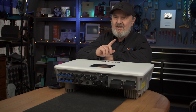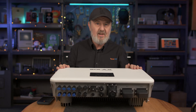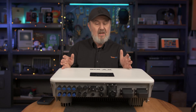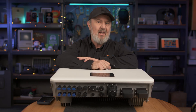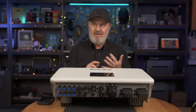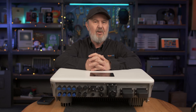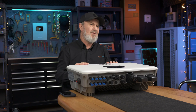The packaging is very solid and well protected. The cardboard insert for wall mounting is a really nice feature. It's compliant with the Australian standard AS/NZS 4777 Part 2, and it also has CSIP AUS compliance natively. In states like South Australia, Victoria, Queensland, and soon New South Wales, this is a feature allowing the network operator — your power supply company — to control your inverter when there's too much solar. Depending on the state, it's known as flexible exports, emergency backstop, or dynamic export control.